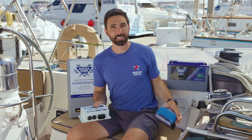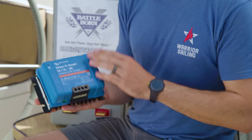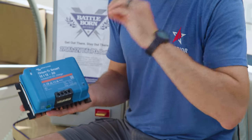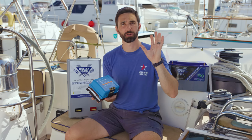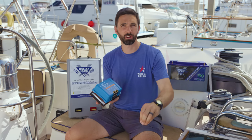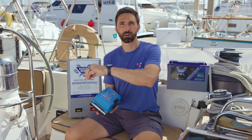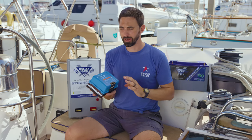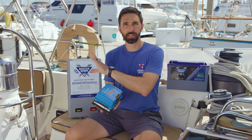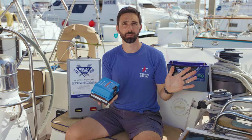The other way is to use a DC to DC charger. This is very easy and very safe, but it doesn't transfer as much power into your house bank as quickly. In this setup, your alternator in your engine directly charges the start battery. Then the DC to DC charger takes power from that start battery and charges it at the exact right voltage that the house bank calls for. If there was ever a problem with your alternator or regulator, it would all be contained on that side of the system and wouldn't get transferred to your house bank, which is running all of your critical electronics aboard your vessel.